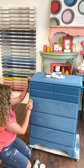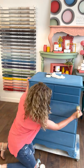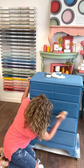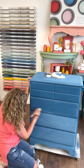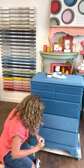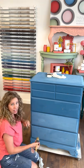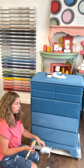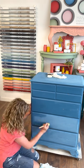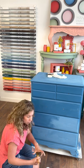Just putting a tiny bit of wax on my brush every time. You can go in all different directions — it doesn't matter. Just get it on there and move it around, and then you can use your t-shirt rag to rub off any excess. You don't have to wipe it off right away either, so I don't have to worry that this is going to dry and cure. I can just go ahead and wax this whole thing and then buff it when I'm done, then use my rag. Or I can do it drawer at a time.